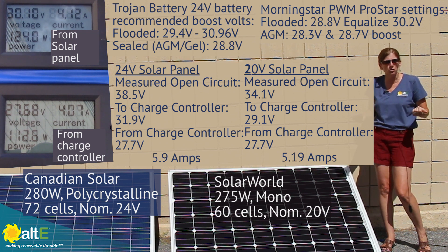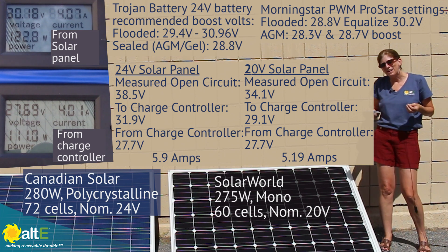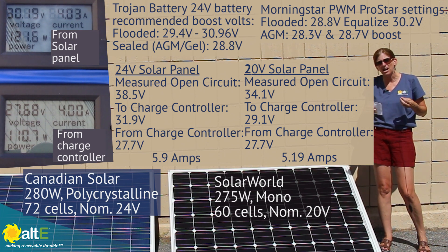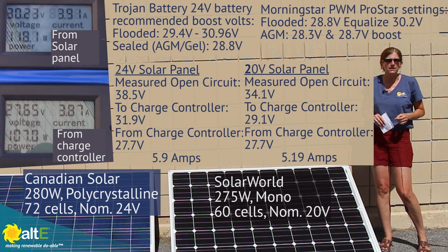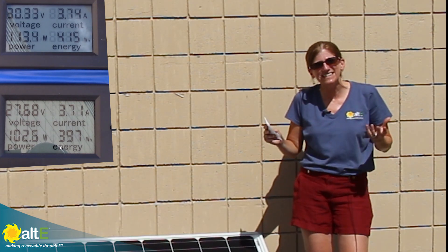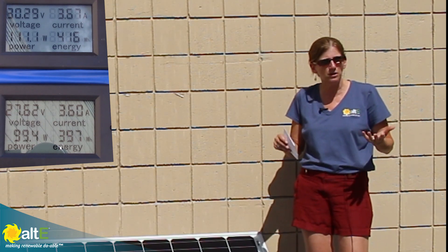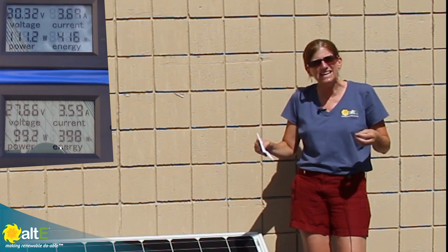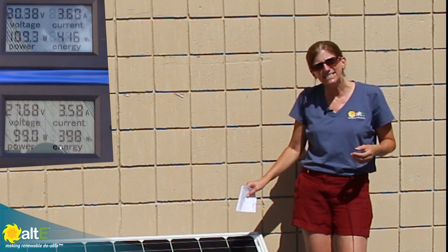In the winter I'll bet it would work great — maybe in the winter we'll do this exact same thing again on a nice cold day. But if you're trying to get the best output and the best charge for your battery bank for the healthiest battery bank, you really do want to use either a 72 cell or two 36 cell 12 volt panels in series to get that 24 volts. There's a reason they picked these size solar panels — the 36 cell for 12 volt and the 72 cell for 24 volts. These are the really good voltages to charge a 24 volt battery.